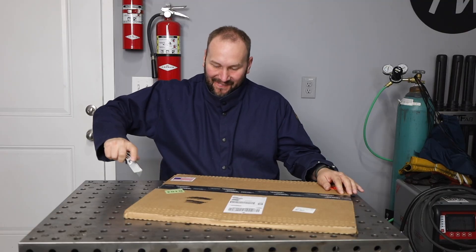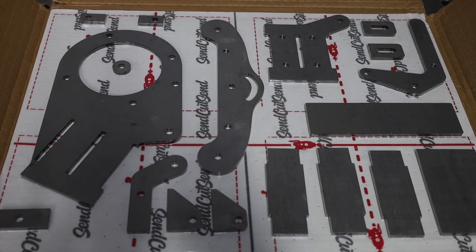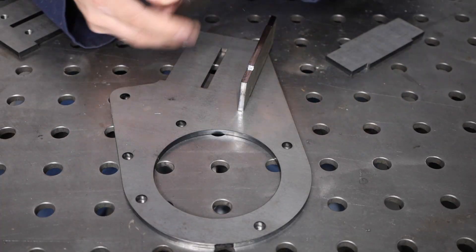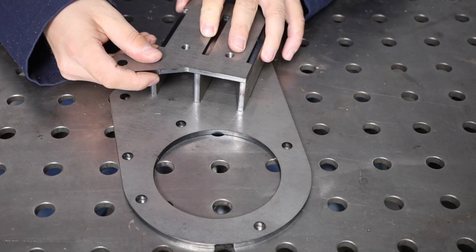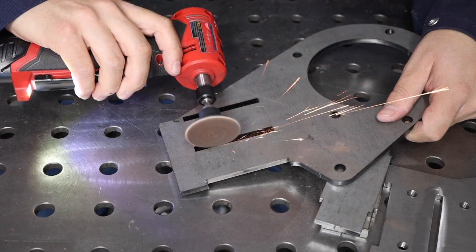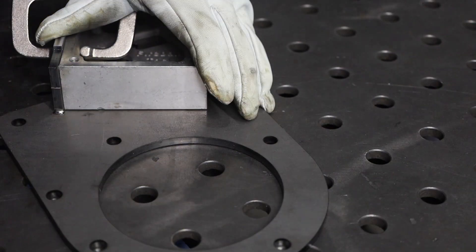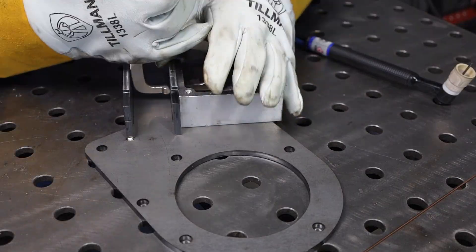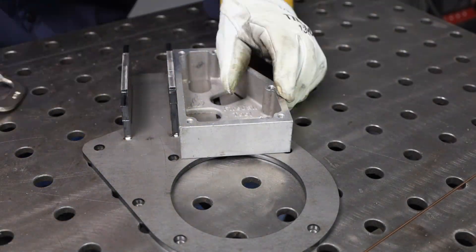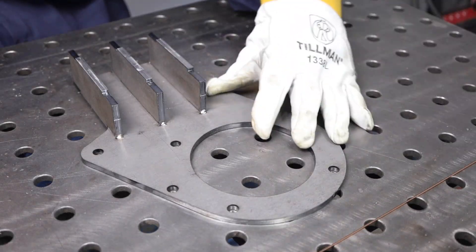It's always fun when the parts arrive to open them up and see these things in reality. I've uploaded the files for these parts and I'll link that in the description so if you want to order your own set to build this you can. Now we're gonna start by building the main chassis — this is going together with a tab and slot design. After I check the fit I'm going to prep the edges with a brown Scotch-Brite pad and then wipe things down with acetone. I'm using a fabrication square to hold everything square, and having these first pieces square is very important for the whole build to go together.